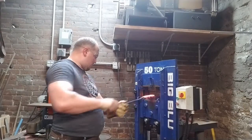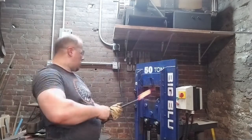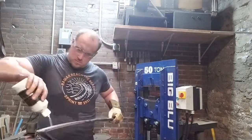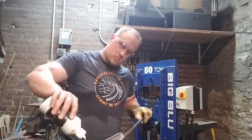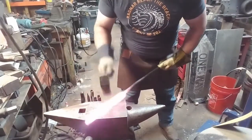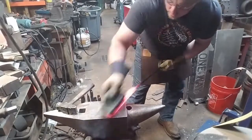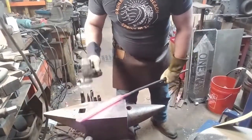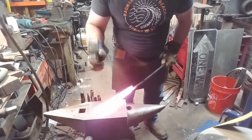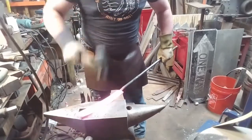This is the wrong stage to get additional width out of the billet. You will, because you're reducing its cross section. But if you try and draw it out, like with a fuller, going the opposite direction, or with a cross peen, you'll pop those welds apart very quickly, and it'll be ugly, and then you'll have a heck of a time trying to drive it back together. So almost every other step, I'm working to reset and reseat those welds, and then flipping over to work on that bevel. And it's a process.